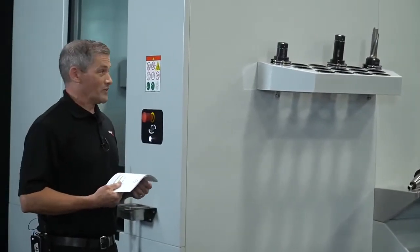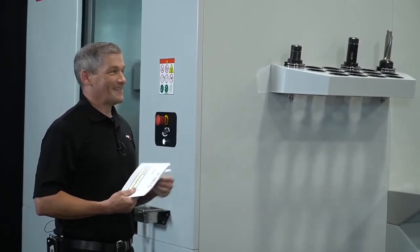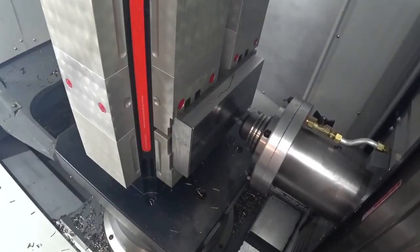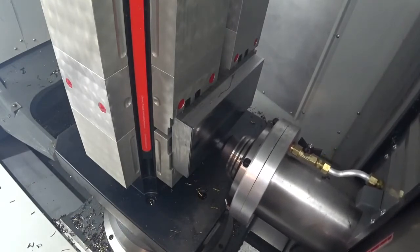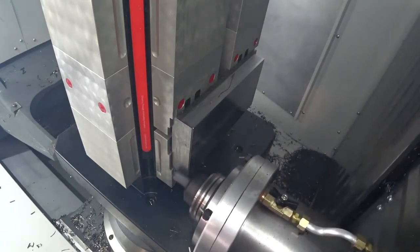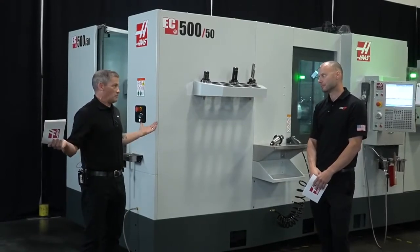That's an impressive program. I was going to ask the YouTube people, if you've ever gotten an alarm for running 150% for more than 15 minutes, I'd love to know what that is, because your cutter inherently comes out of the cut sometimes. I want to know how big of a block you have to have for that kind of engagement. It's a very heavy roughing cut for a long time, so it's got to be a big piece of material.